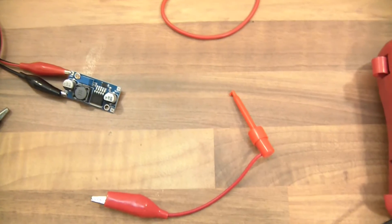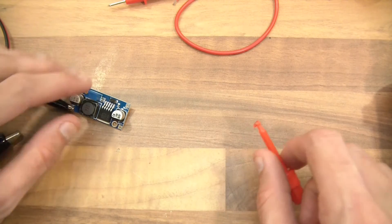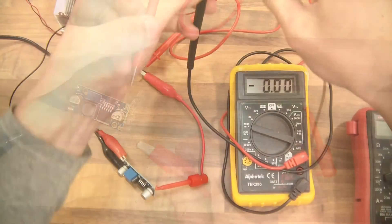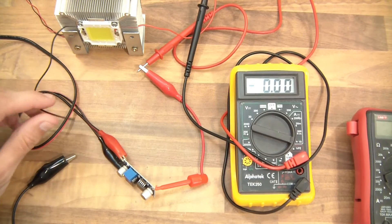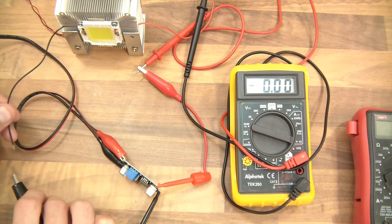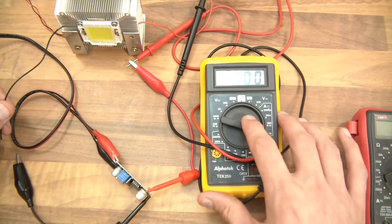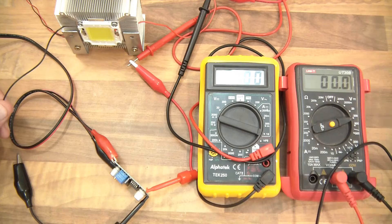Now I need to wire an ammeter in with it. I'm going to use the LED as before, but at 30 volts it won't take many amps. Let's start with the ammeter, and then the black wire back down to the output. We should be able to get a bit of a flash — this is going to tell me the amount of amperage and this is going to tell me the voltage.